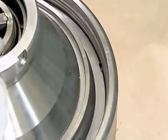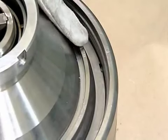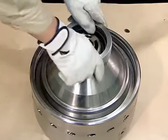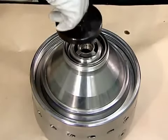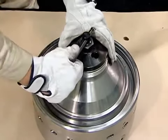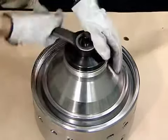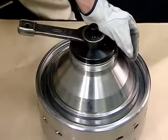The zero mark of each notch position is indicated above the notch. Screw the disc clamp plate into the distributor and tighten the nut with a wrench to compress the disc. Compressing the disc is an important procedure. Its purpose is to dampen the springing effect in the disc mounted on the bowl to protect the thread of the bowl nut and make it easier to tighten the bowl nut.